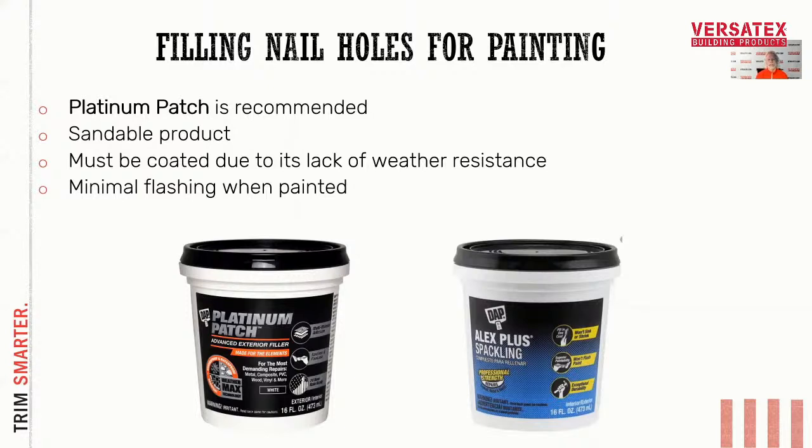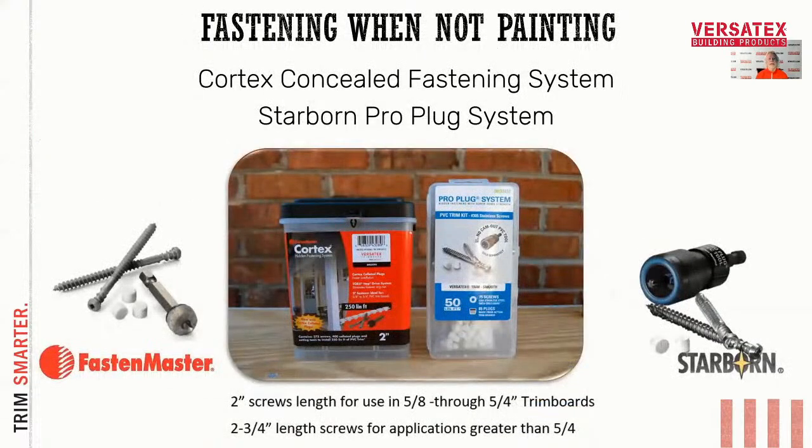Minimal flashing, works well. If you're not painting, the best systems we could tell you out there are the plug system, that's Fastenmaster Cortex, and the Starborn system. Both of them work pretty much the same, a little bit different driver bit. Just make sure that you're getting Versatex plug so that you got a perfect match. If you used a lesser line of PVC and you have more of a grayer wood, then that white's going to jump out at you everywhere you fastened.